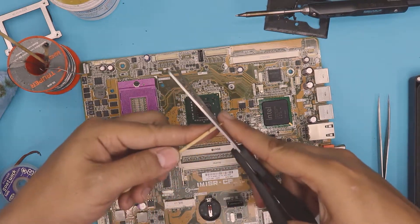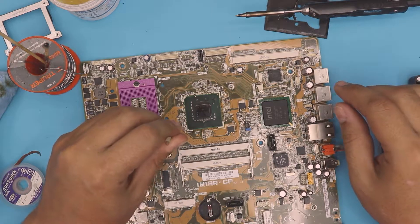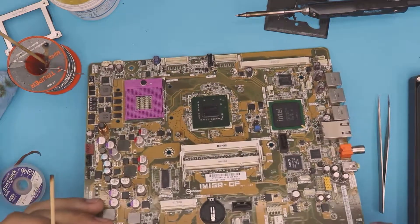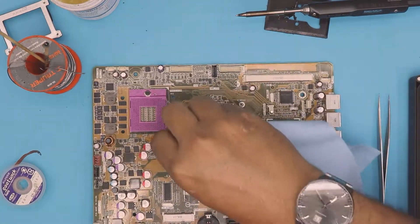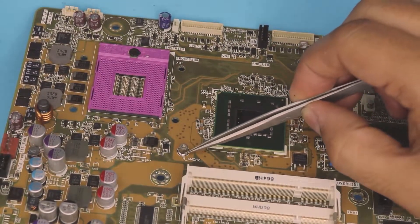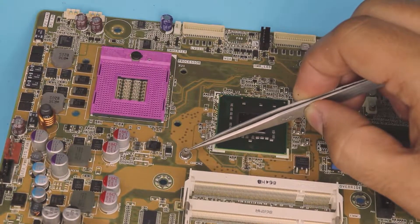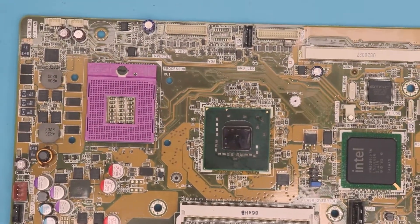There we have it. You can cut a little bit of this one too — it stays there for the better. So now this riser will never go anywhere. This is the proper way of setting it up — there's solder all around it and we heat it up so the solder goes in between them. You do not want to put solder right in the hole because the screw has to go there.